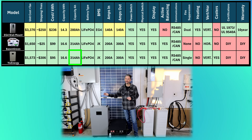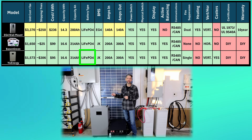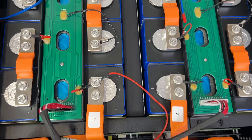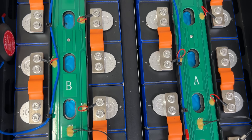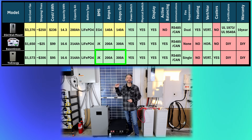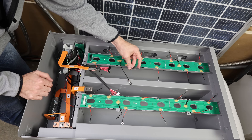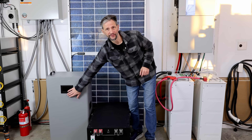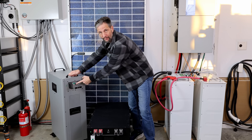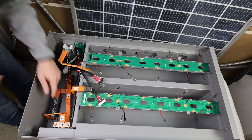Shipping will probably be in the $300 range, but it does depend on where it's being shipped and whether you're sourcing it from China or European stock. Because these 314 amp hour cells have an actual capacity of 325 amp hours, this pack will have a 16.6 kilowatt hour capacity, bringing the cost per kilowatt hour — not including shipping or fees — to $95 per kilowatt hour. Depending on your shipping situation, it could be the cheapest option. The cells are the same stable lithium iron phosphate chemistry, but they have double-tapped battery connections. Having two connection points for each post makes it easier to guarantee no high-resistance connections with the assembly — that's just a little safer way to put it together. Both the horizontal box and the vertical box come with the 200 amp JK BMS, delivering 200 amp input and 300 amp output with built-in fully controllable active balancing. The PCB is used to connect all of the cell sensors including temperature sensors, resulting in a much cleaner install and layout. The BMS has an on-off switch and there's a dedicated 200 amp breaker for full disconnect.